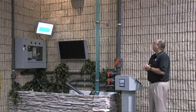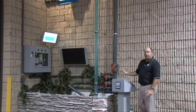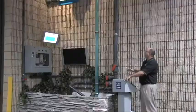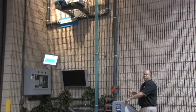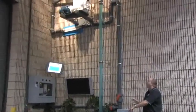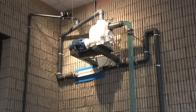We're using a 15 horsepower motor with our pump, and we're running at about 1650 RPM pump speed for most of the demonstration. The first scenario we want to look at is using the across the line starter to run the pump. This is going to be a full on and a full off situation. So what I want to do is from the control panel here, I'm just going to run through a couple of cycles of start and stop, and we're going to keep our eye on that discharge hose and see how quickly the fire hose fills with water and with a certain amount of violence or force that it does fill that line. Again, this is a three-inch pump with a 15 horsepower motor, not a large amount of horsepower or a large amount of flow that we're talking about, and you just see how much water hammer or shock that we can put into the system here.